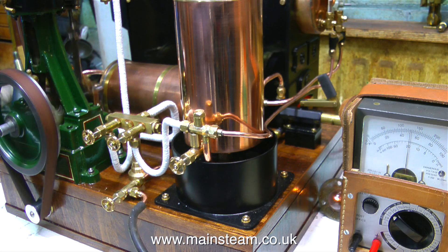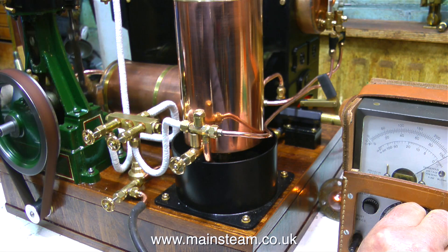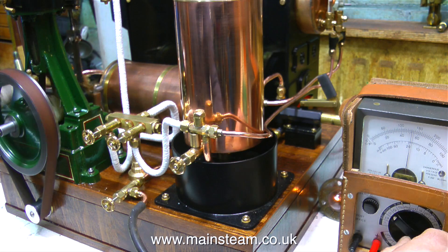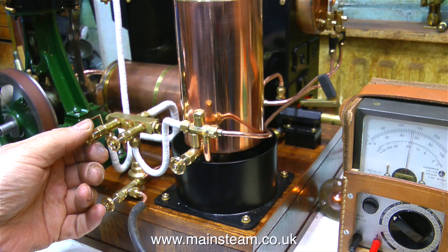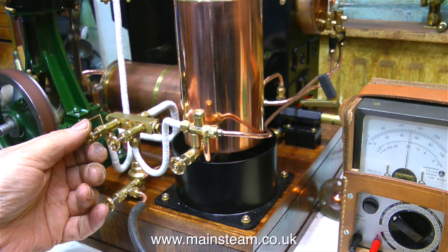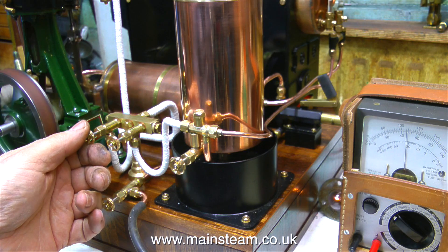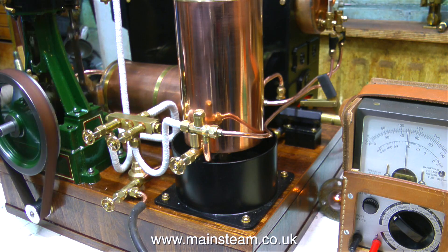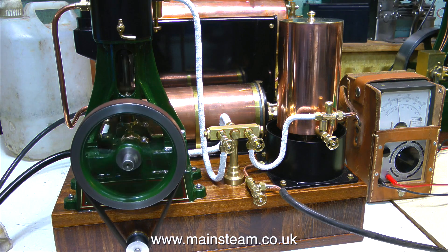That's too fast. If you have a look at the main drive pulley to the generator, you will notice that I fitted some different o-rings on there — they're much thinner and they're not silicone, I think they're made out of neoprene, but they're doing the job. I may machine the pulley a little bit smaller. Alternatively, I could use a tooth belt pulley and use a tooth belt round the flywheel, although I do think that the nice brown leather belt is more industrial revolution.